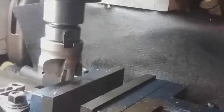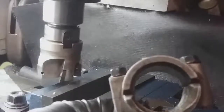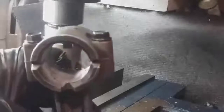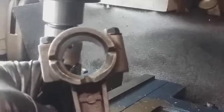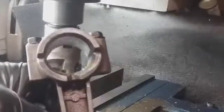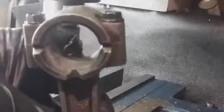Here's what it is. Let me grab the other piece and bolt them together and we'll take a look before I get to the next step. So here we are - I trimmed both the upper and lower. You can probably see it is somewhat ovalized. That's what it basically does - it shortens the hole so that way you just have to make it re-round with the boring head. That's what they do with engine machining for anybody who doesn't know. When they rebuild an engine. So the compressor has a reciprocating mass just like this - that's what I'm going to do.